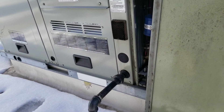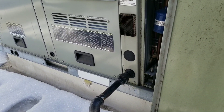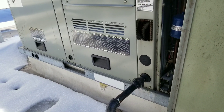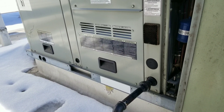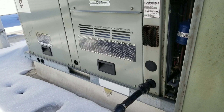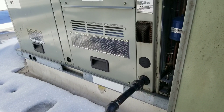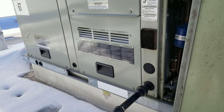The pressure switch issue could be related to this inducer motor. It's blowing air, but if I had to guess it feels like about 80% of a normal fully operational inducer motor. So I'm going to power it down, pull the panel off, inspect the inducer motor, see if the pressure switch is blocked, and check if there's something inside causing that racket. Chances are it's just going bad.